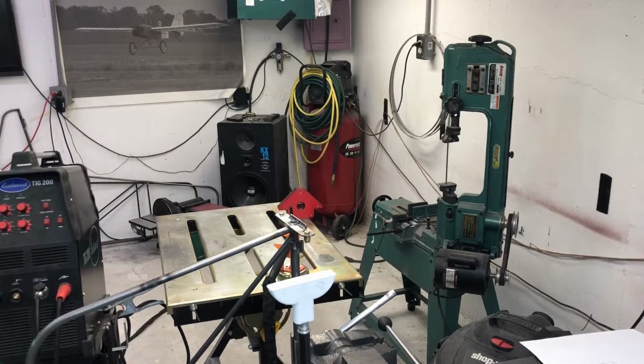Okay, everybody, one important thing to make sure is you cover every inch of your body, because last month I did a little bit of quick aluminum TIG welding on my fuel tank, and I forgot to put my long sleeve shirt on, and I actually got quite the sunburn from it, and it's not healthy, all that ultraviolet light that comes off welding. It's really quite dangerous. So you need to really make sure that you're covering your body and you're not getting a sunburn, because it's very unhealthy. Yeah, I should have had all this set up before I started the video.